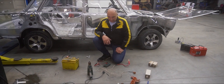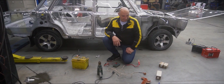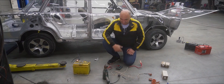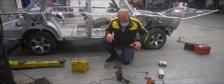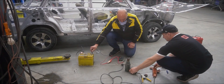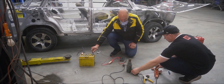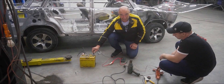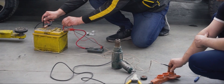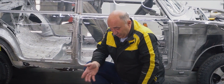Since we haven't seen a crazy increase yet, see what we've decided to use — an industrial-grade heat gun. That 300-watt light bulb is the biggest one we've got. We could have tried hooking up a few in parallel, but we just don't have enough sockets, which is why we've whipped out the heat gun. It's got two speed settings and it's rated at 1600 watts. Now we see what happens when you replace the light bulbs in your circuit with a heat gun. 3 amps — holy cow! That's on the lowest setting. We're looking at 3 amps — that should be enough to charge a battery. We've got 13 volts, jumping between 12.7 and 13. Even with that heat gun, we're not seeing any more than 13 volts — everything's good.